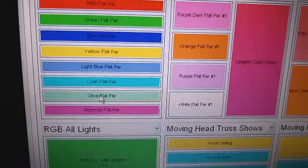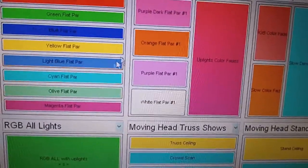Now with everything hooked up, I'm going to hit a couple of buttons in Show Express. Say you want to go to purple — and this is all wireless. The camera might not do great justice to the colors since it has a CMOS lens, but that's purple. Say you want to go to orange — it's going to fade to orange. Say you want to go to cyan, and then magenta. This basically shows you that wireless DMX does work: the transmitter is over here and the receiver over there is sending the signal to both lights.